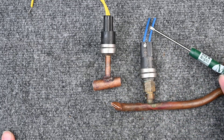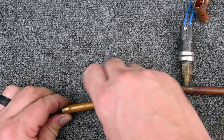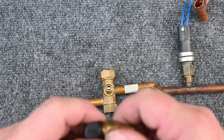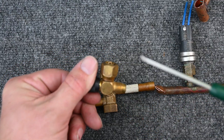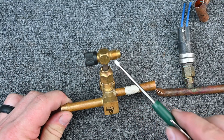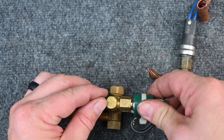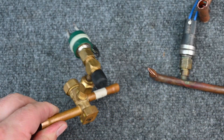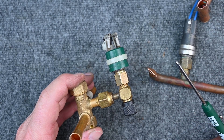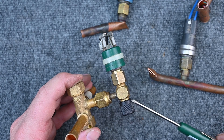A lot of people simply cut and bypass these switches, and that is a problem. Bypassing a safety is never an answer, but there is another solution. If this is a high pressure switch, we have a high-side service port. We can get a T-fitting that has a Schrader port depressor on it. Thread it on and it presses the Schrader core down. Now one fitting has become two: I still have a place to connect my refrigerant gauges, and I can put the pressure switch on the other port. Wire up the new pressure switch — safety is hooked up and everything is operating. It's not factory-perfect, but in some scenarios it's a decent option.